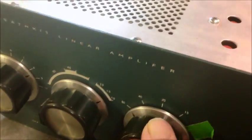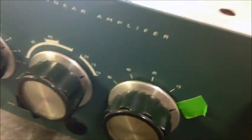What we did on this is we basically converted it for 10 meters. All the band functions still work — still has all the band functions in it, so the ham can take it to all the ham bands all he wants to. We just did the necessary things for the 10 meter, and it's basically a pretty easy procedure.